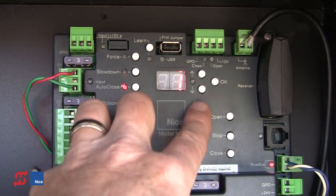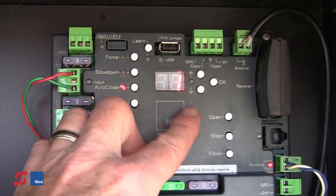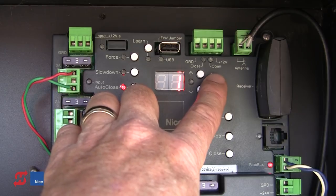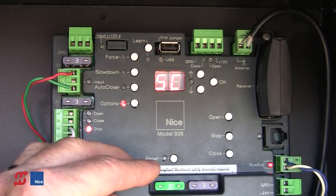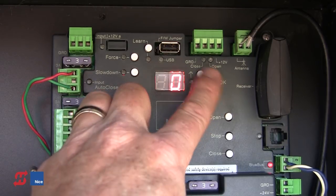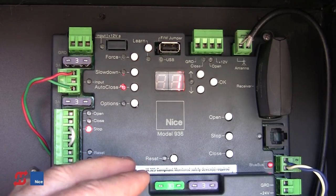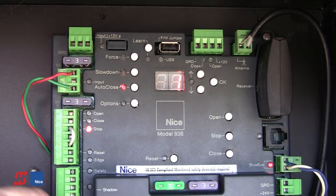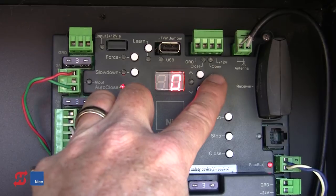The next selection is standby mode. By default, standby is on — recommended — where the board goes into a low power state after 20 seconds. You can turn it off if desired, but I recommend leaving it on, especially for solar applications. Next is SC for Gate Synchronization, only for dual gate applications, which tries to synchronize the two gates so they reach fully open and fully closed positions at the same time. When using this feature, always connect the fastest motor to Motor 1, as it will slow that Motor 1 output down to match the runtime of Motor 2. Default for this is off.